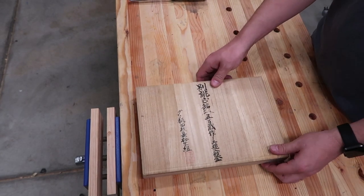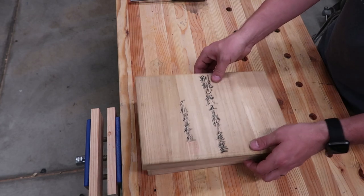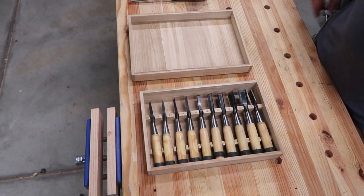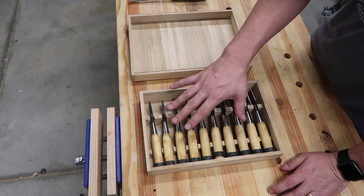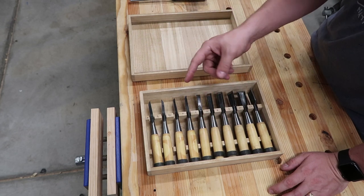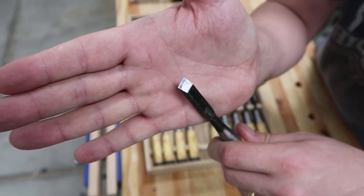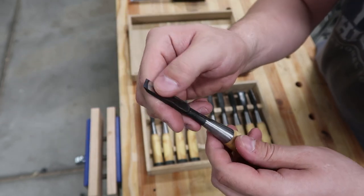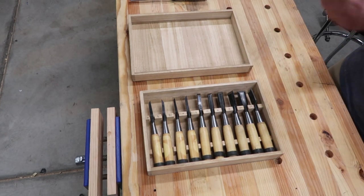And then my favorite chisels became this nice box set. They were hiding behind glass locked up at the store that I found them at. It's dried out so much that there's actually a crack going down the box. When I got them the hoops weren't set - I just recently set these hoops finally. I thought they were set before, but because we moved from somewhere super humid to somewhere really dry they just got loose, not knowing the hoops had to be set. So now they're all set and they're really nice. You can see the lamination in the steel - that real nice lamination. The backs are all hollowed out so they can be flattened. They did not have a mirror polish on any of these before, but using sharpening techniques I see online I got them super sharp with my 12,000 grit stone.